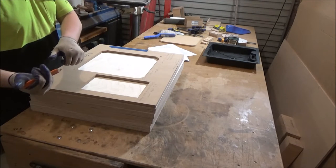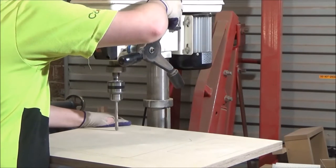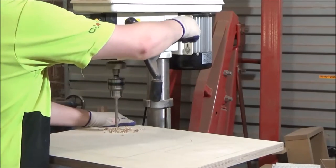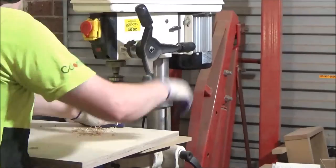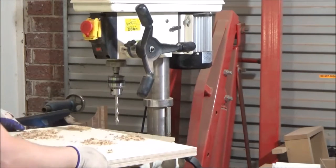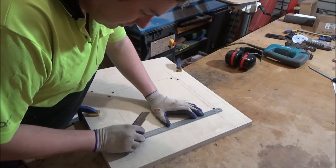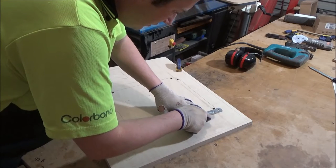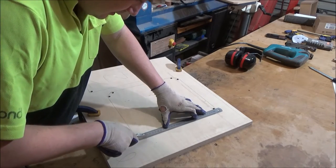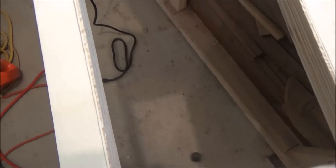He wants this section to move over that way 10mm and up that way 15mm. So I'm just knifing a line right next to this line here so that when the jigsaw comes through it doesn't pick up this top surface - you can't really see it but I don't want it to be a mess. Here you can see the effect of knifing those walls - it breaks out right on the knife line but not past the line, so it would have been a mess if I didn't do that.